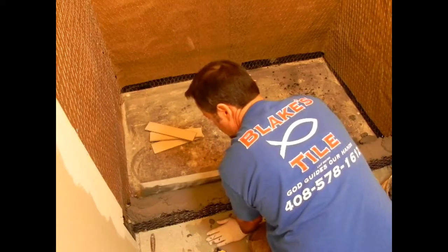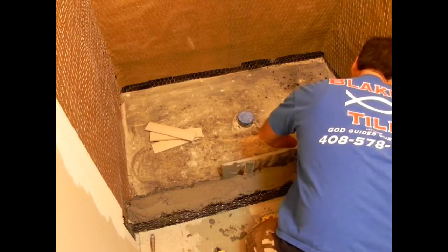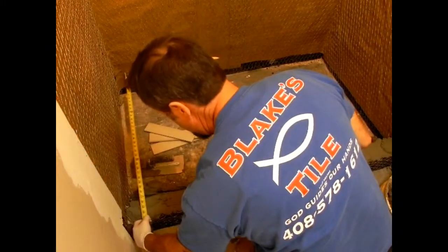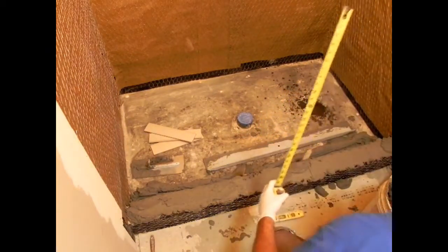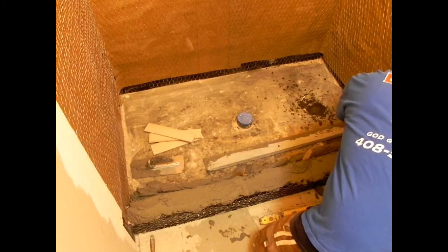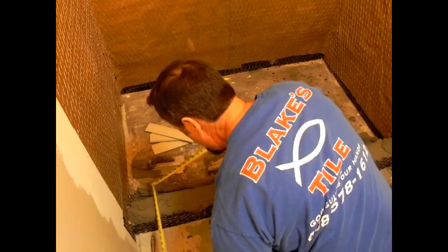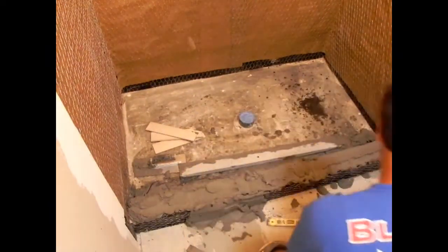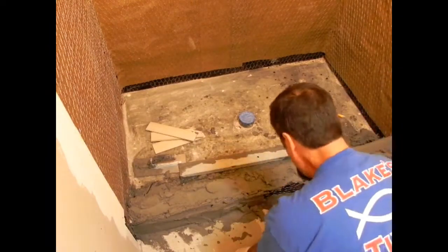Normally you want to put them as far apart as you can. Metal edges are great, but if you don't have one any kind of straight edge will do. What I'm doing here is called rodding off the mud. I'll check again further down — and it's right on. So now I'm going to check my wall behind me. With fat mud and floating I can fix this curb to be perfect with my back wall, so my outside tile will be square to the curb, and then I can float my shower inside with fat mud to make it all square to the curb so everything will be square.